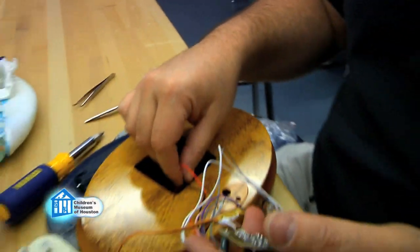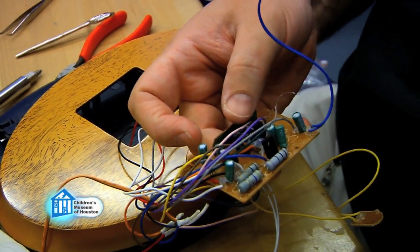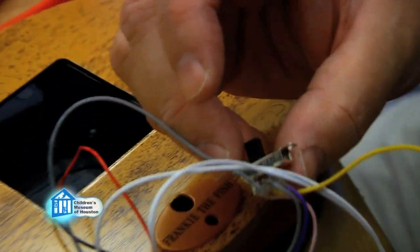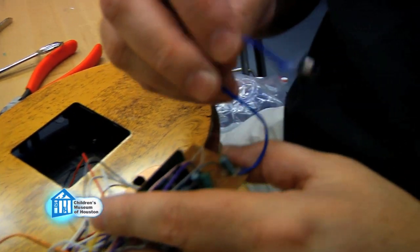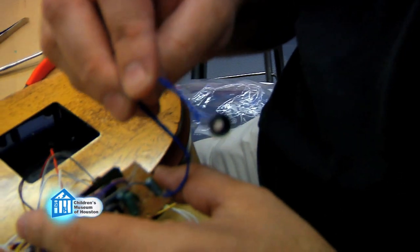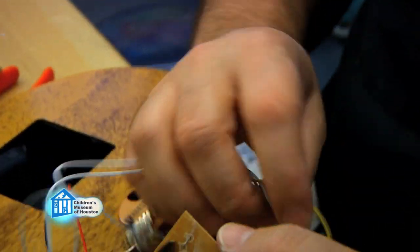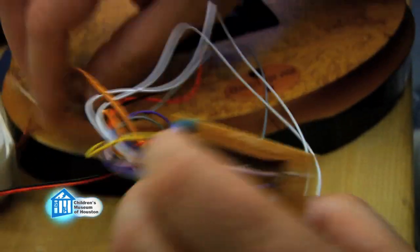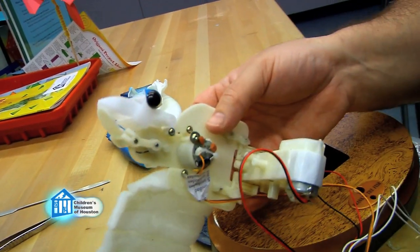To summarize: we have power coming from the batteries inside here, running up through these cables into the circuit board. The circuit board then has wires that run to lots of different places. One of them is the switch, which controls what song is played or whether or not the sensor works. Here's the sensor — a photoresistor that senses light, so if someone walks in front of it, the fish knows to go off. We have the speaker, which plays all the sounds. The button, which you can use to activate the fish as well. And finally, a couple of wires running to the two different motors inside the fish itself, which control it moving in and out from the base and the mouth going up and down.